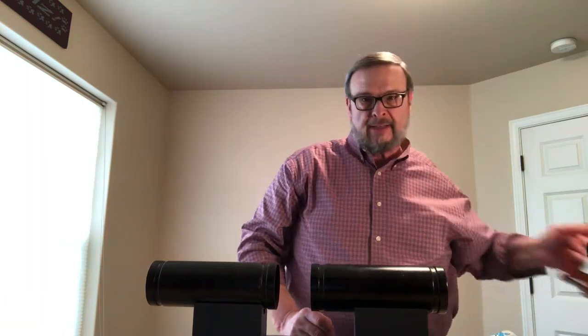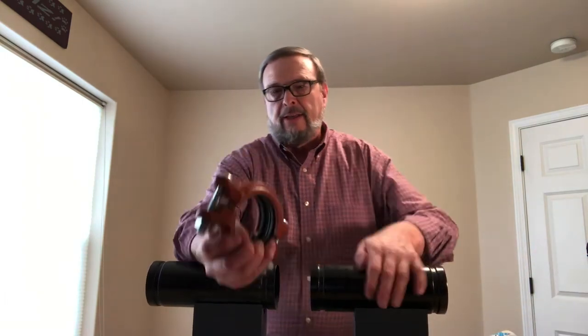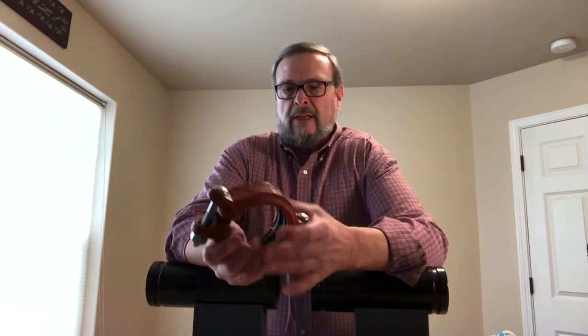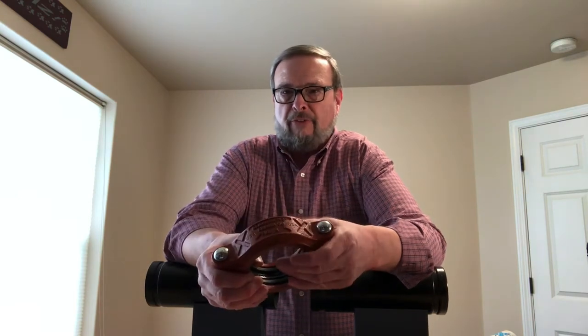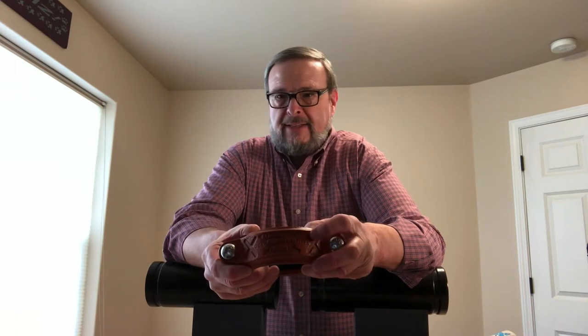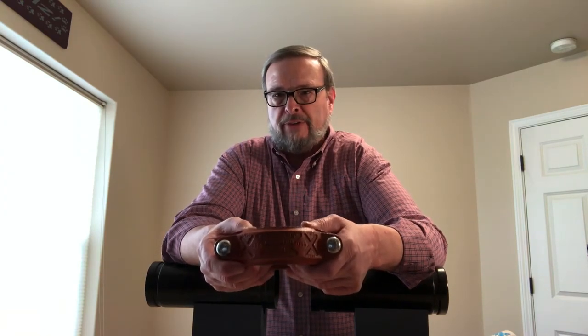The other part I want to talk about today is the slide lock. This is GrooveLock's ready-to-install coupling — it's a figure 74. It's a rigid coupling; the X tells us it's a rigid coupling. All GrooveLock couplings that are rigid will have an X on them.